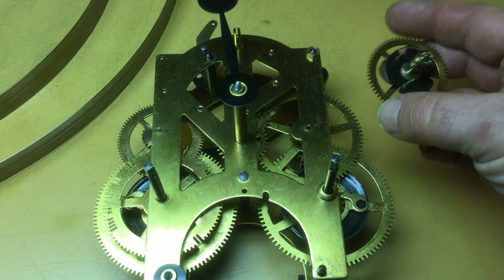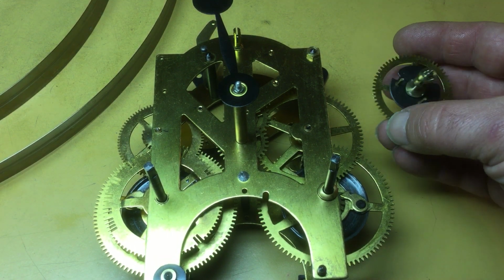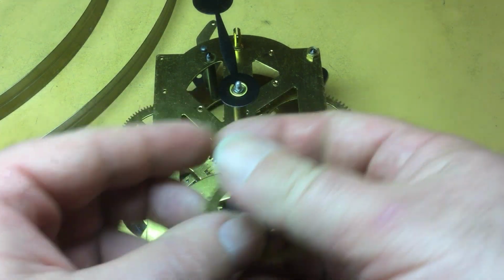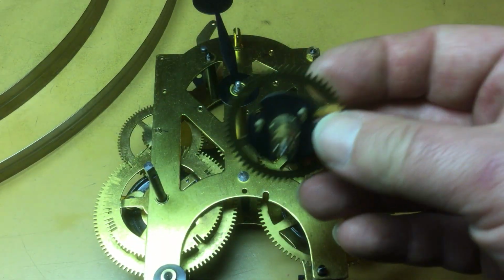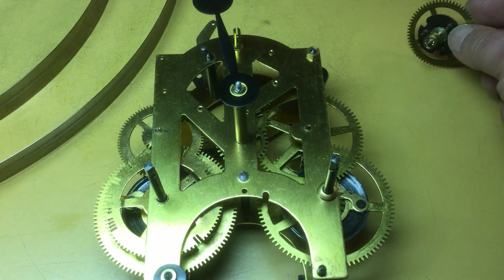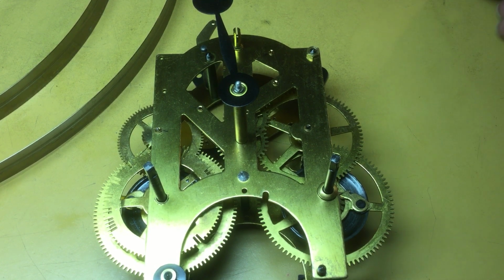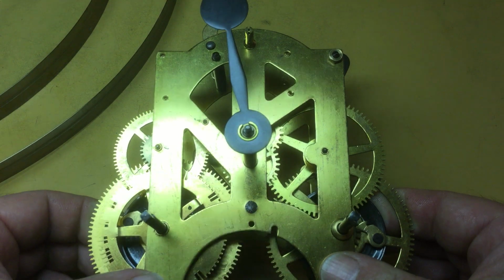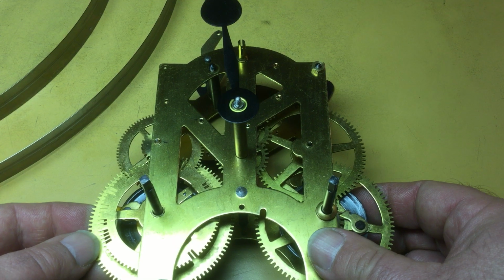And I still find this interesting too, the 3 lifting pins and 3 locking slots on this. So not only are you getting some gearing changes here, but you're also getting less total rotation in the rest of the gear train, so the gear ratios are not quite as high as they would normally be, even with that. So very interesting stuff. Anyway, we'll call this video 5.5 since it's not really, or is it 6.5? I don't know. I think it's part 5.5.